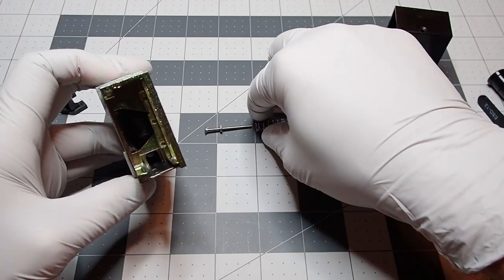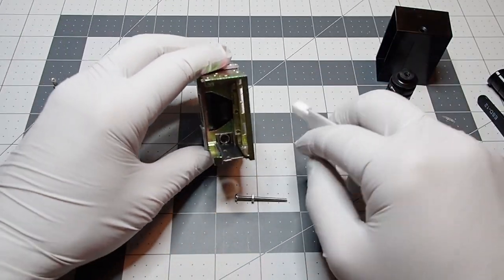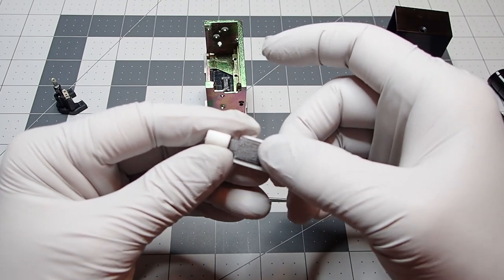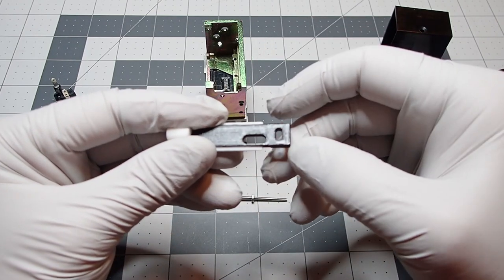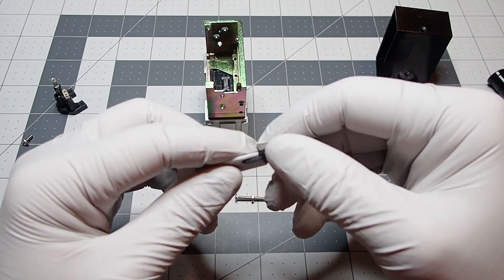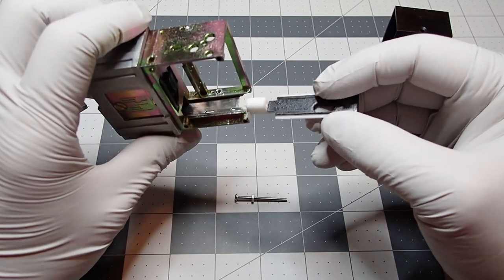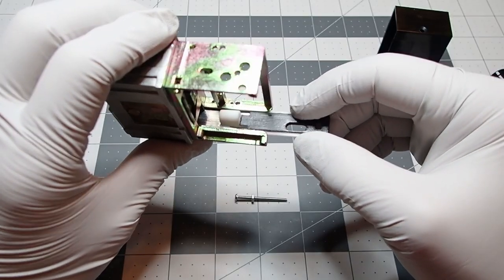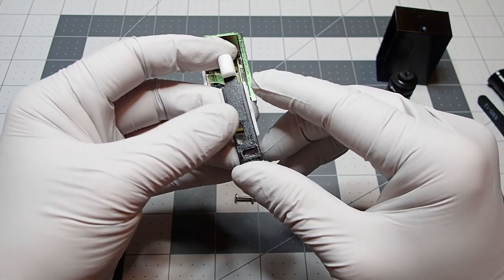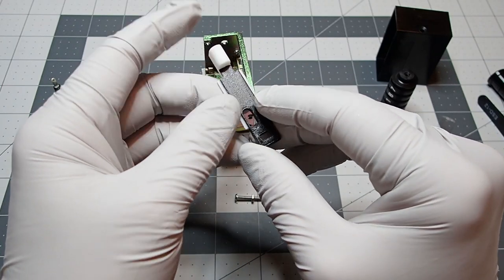And the next part here, let's see here, put the spring right in there. This part, we'll talk about this just a little bit. So this comes originally just plain white. I did put some black primer paint, and I put a coat of Future Pledge floor gloss floor wax on it just to give it some shine to replicate what the vintage button might look like. But what I had to do here was this part, when it came, it would maybe go in that much, okay? It would not continue to slide in. So what I ended up doing was sanded the bottom down, sanded both sides, tapered it just slightly on this edge there, and that was sufficient for this.